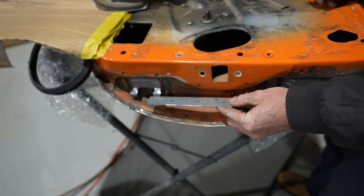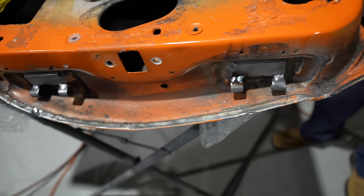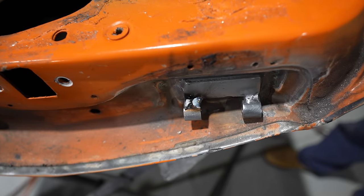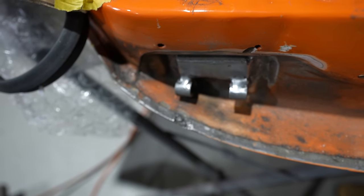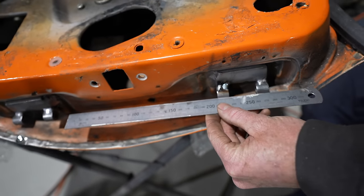And I'm sure if it wasn't, Dad would be over here with a fine-tooth comb going over that. Yeah, we're making sure that it's perfect, as he does. And the thing is, when you go to weld these little barrels on, they're not that big. Be very careful, because you can have them almost perfect where you want them, and you hit it a little bit too hard with the welder, a bit too much heat, and all of a sudden they're tweaked and you're back to square one.